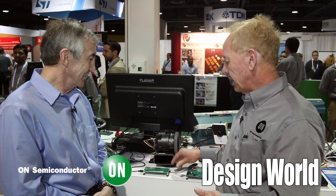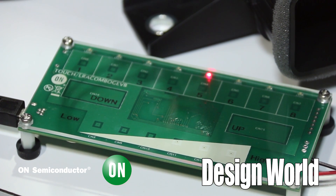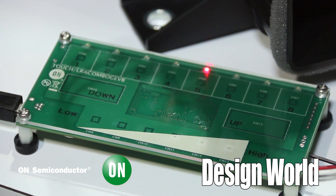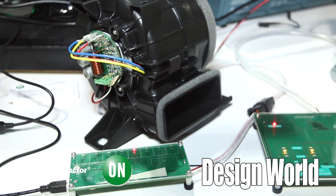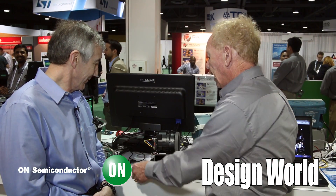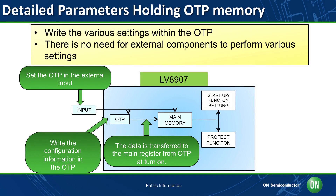What we've attached here is a simple touch board that changes the PWM input into the motor, so you can get it to drive faster or slower by changing the PWM input. But if you were to switch off this board completely, the motor will still run based on the registers that are internal to the device. The main controller in the car doesn't have to be continuously monitoring this motor — it can just turn it on, say run at medium speed, and it doesn't have to think about it again. This will run itself.